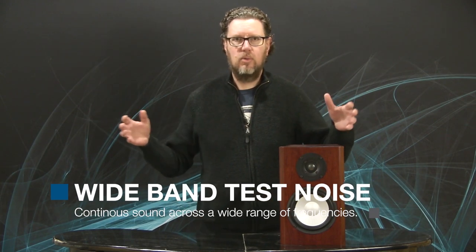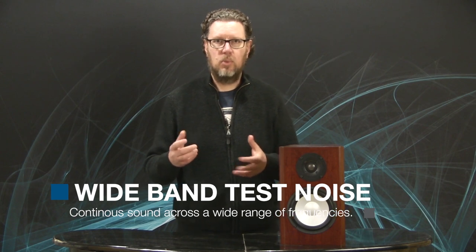One thing that's very important to realize is that even if you follow a standard for power rating of a speaker, usually the test signal that's used is wide band and fairly continuous. What I mean by that is it handles pretty evenly a wide range of frequencies that the speaker might cover — sometimes pink noise, white noise, or some modifications of those things. But often those power tests don't include the kind of dynamics and frequency response bumps you might encounter in music or sound effects in movies.